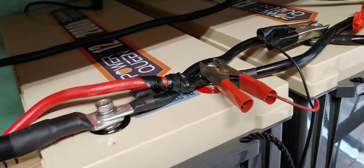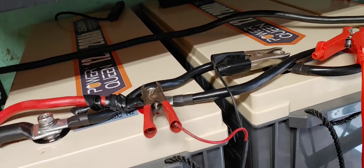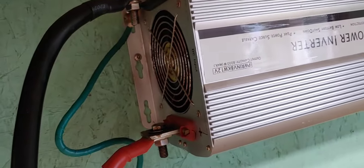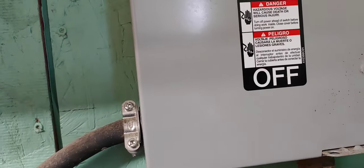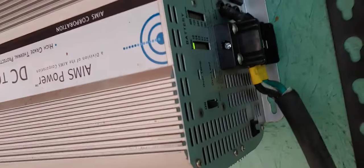Each of these I saved for a long time until I could afford the lithium batteries I wanted and the system I wanted. In the end I'm going to have a 10,000 watt system that will run my entire house when the power goes down. I have these two gauge wires that go from my inverter to the batteries. The inverter goes from the box right there to a cutoff right there — an automatic switch, so when the power goes out in the house, this automatically comes on.